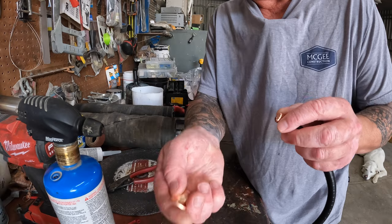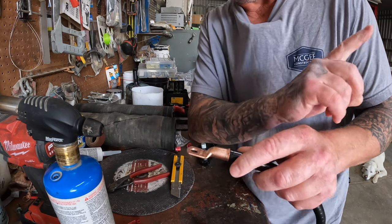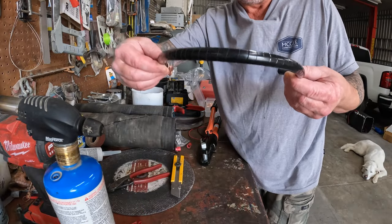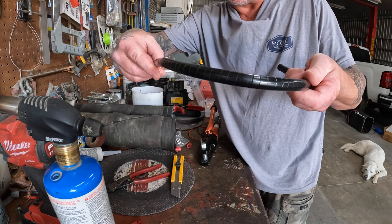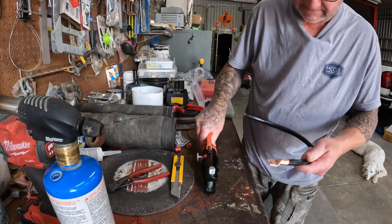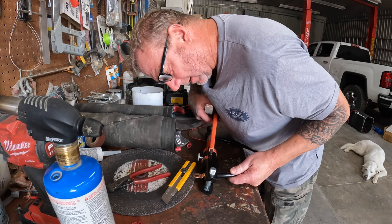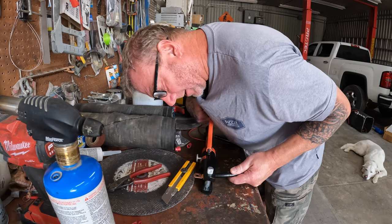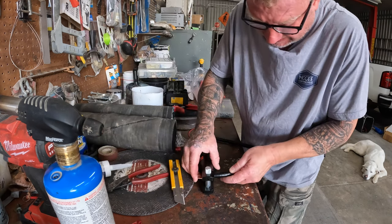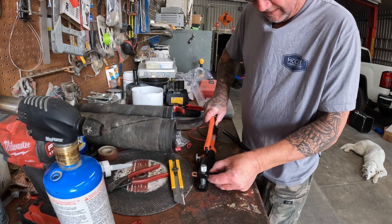This is a 2-ought lug to 3/8-inch stud — it's 8mm bolts on top of the batteries. These are going to join the negative to negative. This cable naturally wants to lay like this because it was coiled, so I'm going to turn the lug so it lays correctly. This is a hydraulic press — I bought it off Amazon. It does pretty well but it doesn't have every die that you need, so sometimes you have to work with it.